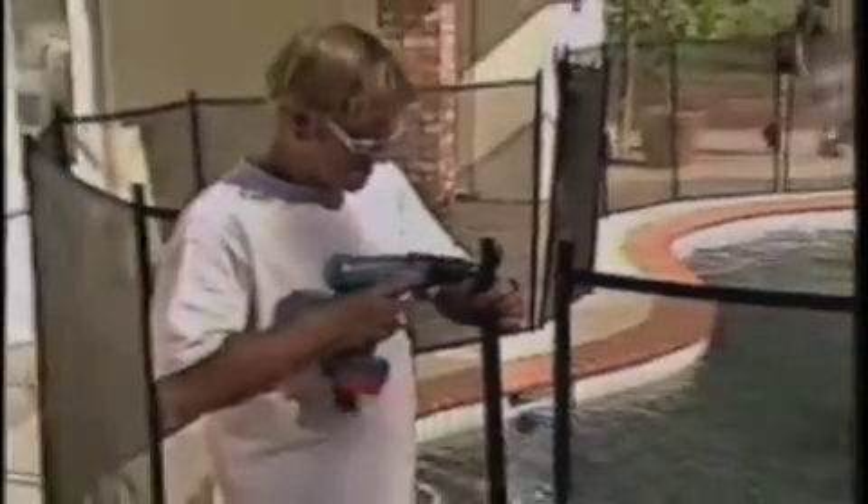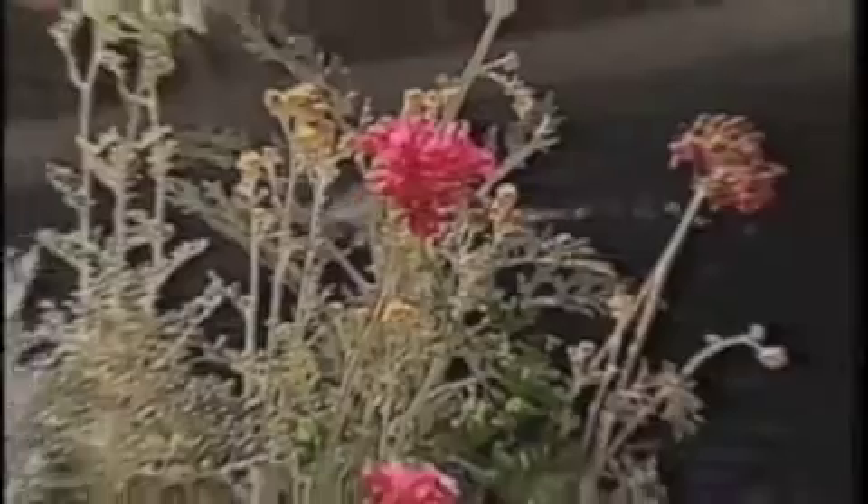Your Kantar Protect-a-Pool removable safety fence is almost complete. Use your hex head bit to remove the top screw of the poles wherever two panels meet. On a step, remove the two highest screws that are adjacent to each other. Carefully attach hooks and eyes into adjacent holes — you can use the hook for leverage. Be sure not to apply too much pressure; if it doesn't fit, remove and try again. Now attach your panels together. Use a small amount of common all-purpose glue to attach the vinyl post caps. Be sure to move any tall objects away from the fence so children cannot climb on them to get into the pool.